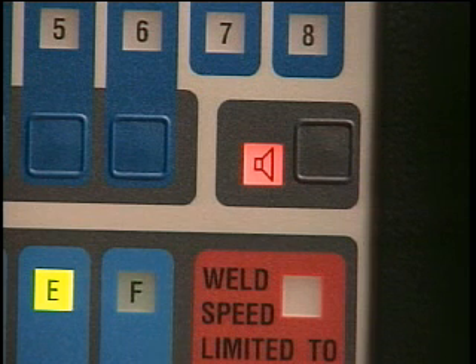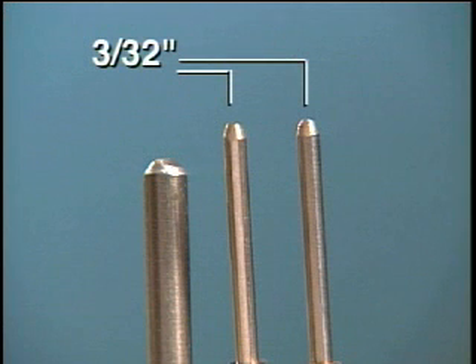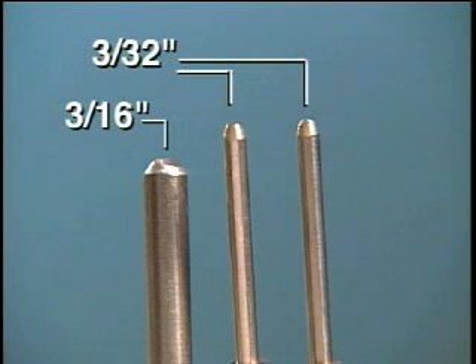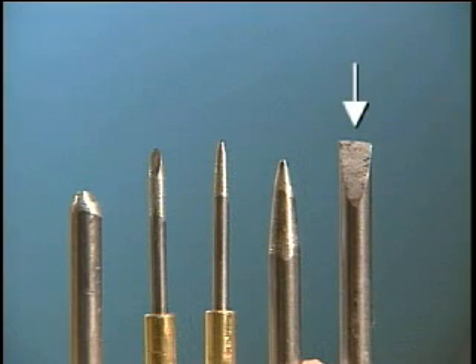Next, we will insert an electrode into the holder. There are two sizes of electrodes: a 3/32-inch diameter electrode and a 3/16-inch diameter electrode. The smaller 3/32-inch diameter is the one used for most welding, especially on small parts. Note that the end of the electrode is rounded — this is the shape which must be maintained to gain satisfactory welds. There are other situations which call for other shapes, such as a spade shape, which works well for inside corners, and a somewhat pointed end, which works well for very fine welding. These shapes can easily be obtained by sanding or grinding to the desired point.